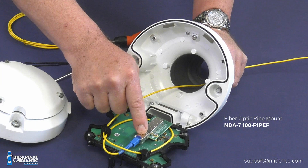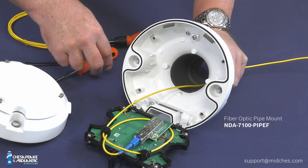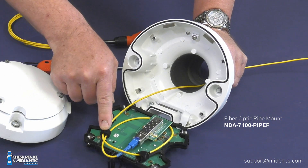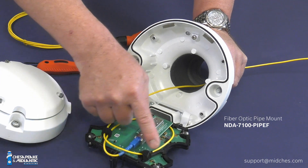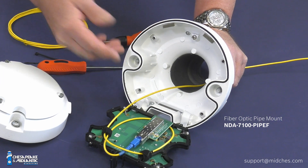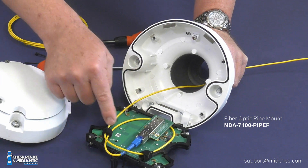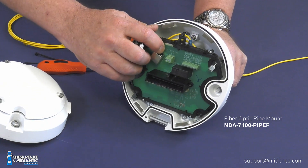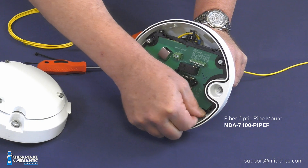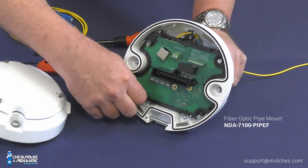The SFP is connector-specific. You need to know it's a 1 Gig connection, and you need to know the type of connector you'll be using on the fiber. Velcro or small wire ties can be used on the strain relief pieces. Once you've done all that: put the board back in, feed the wire, push the SFP into the socket, connect the wire to it, do your strain relief, put the board back in, and tighten your thumb screws. Don't wrench them to the point of breaking them off or cracking the circuit board — tighten with a screwdriver so they don't vibrate loose after you get them finger tight.